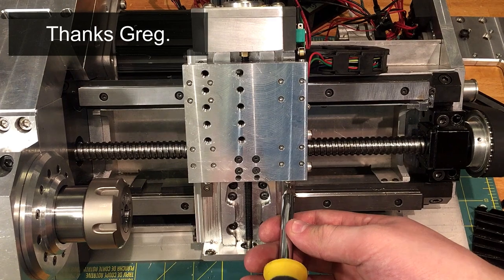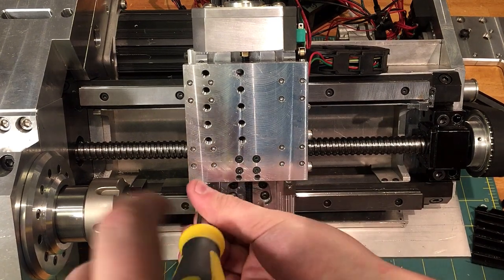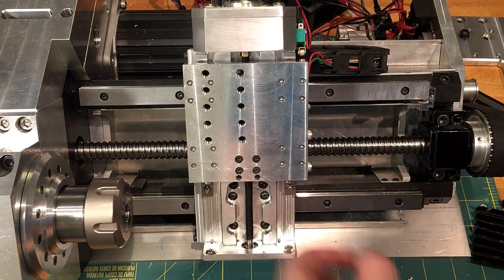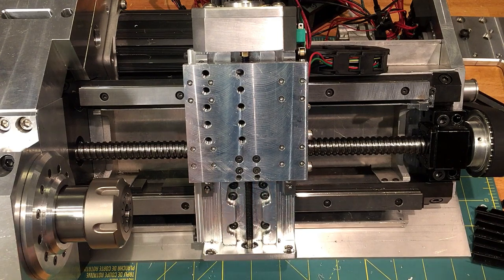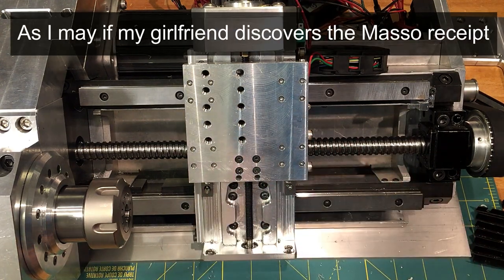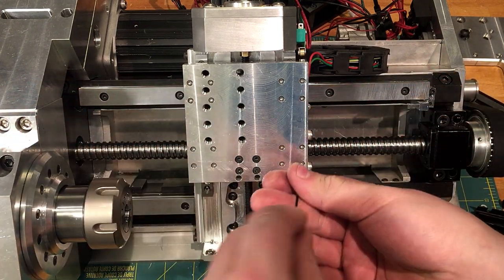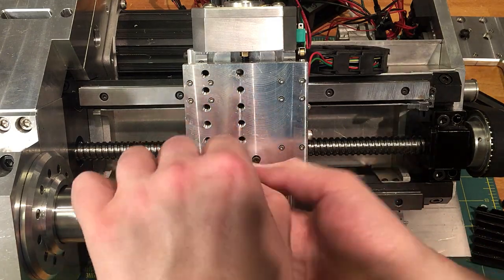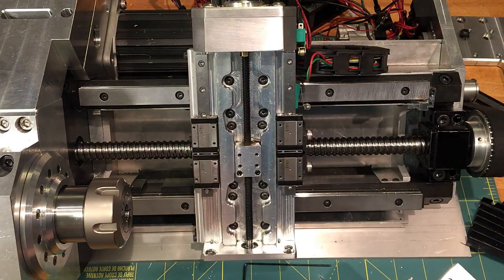So what I'm about to do now is very important. I'm going to back these fasteners out, even though they're not coming off, and leave them. That's mainly because when I undo these guys, they're going to slide right down and I'm going to lose all the balls again. From here you can see how the carriage is attached to the rails — you've got the rail carriages and the lead nut. Now we just have to undo the nut. Awesome, there you go.